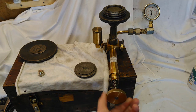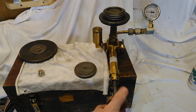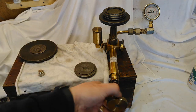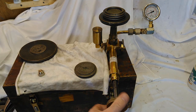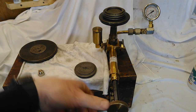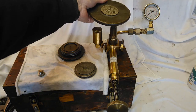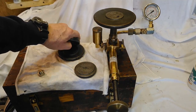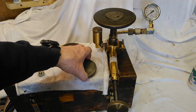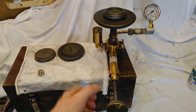Right, so we'll wheel it off, and what we'll do is we'll put a big weight on it this time. We can't go up to 30, but we can almost go up to 30, because 30 would overread and would go right off the end stop. So we'll stick a 20 on there. 20, 20, 24. Let's just do it up to 25, shall we?